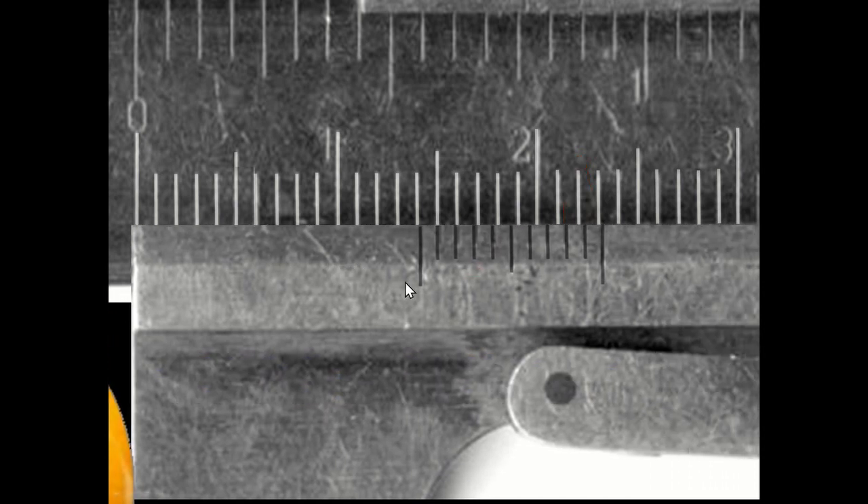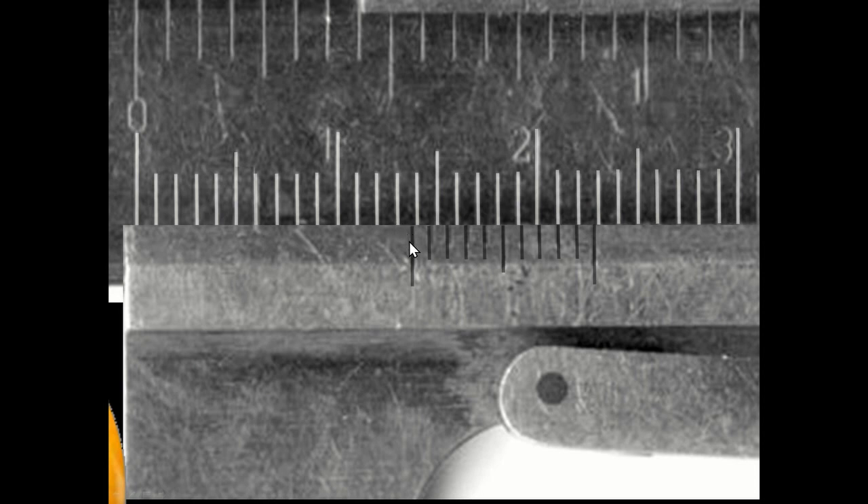Let's close this down and see the measurement. It's where this line hits that scale — clearly it's 1.3 something. If you had to guess, you might have guessed 8 or 9 in between there. But notice those two lines line up and nothing else lines up — that's the 8th division, so that's an 8. I'm not guessing at that; I am guessing one place past that, and 0.005 centimeters would be the best I could do.